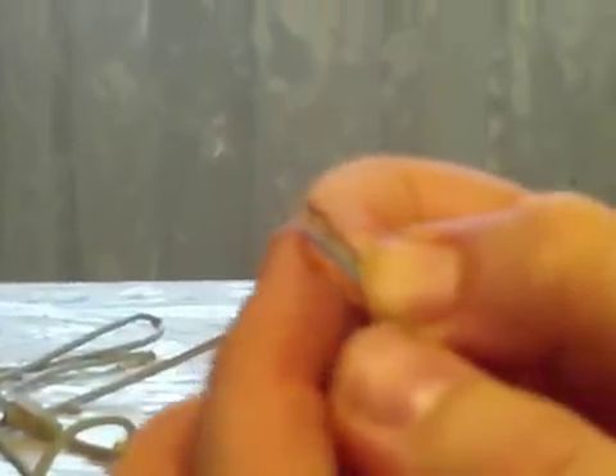But remember, we've got to cross them over. These two wires — orange-white and orange — are transmit. This wire here, the green-white, is receive, and the solid green here on wire 6 is also receive.